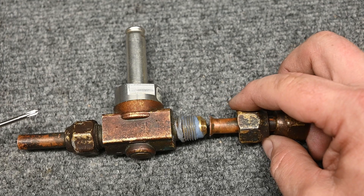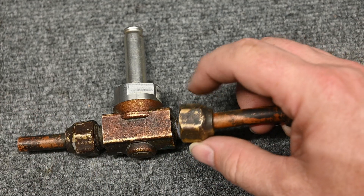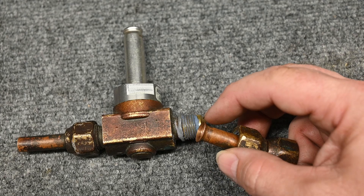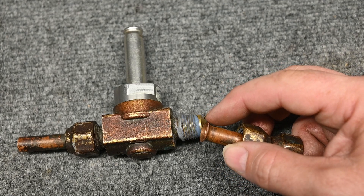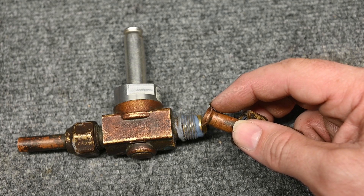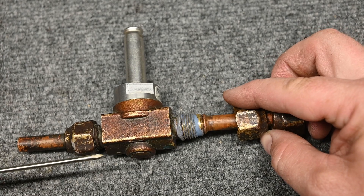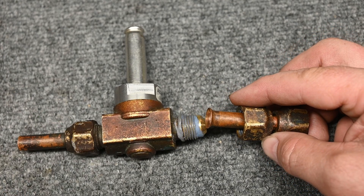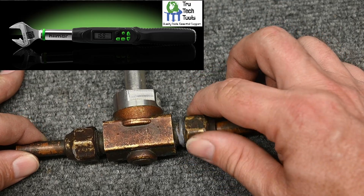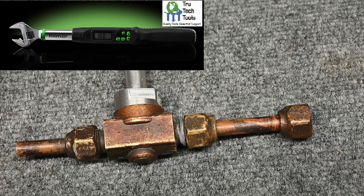Notoriously people have run into problems where they have leaking flares. So what do they do? They over-tighten the flare nut. If you over-tighten the flare nut, it puts extra pressure on the flare, which causes the copper to squeeze out even more and it cracks or fatigues. People over-tighten these and cause them to leak by simply over-tightening. There's a torque wrench, and we torque these connections down.